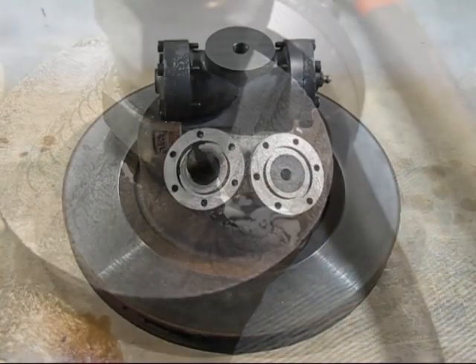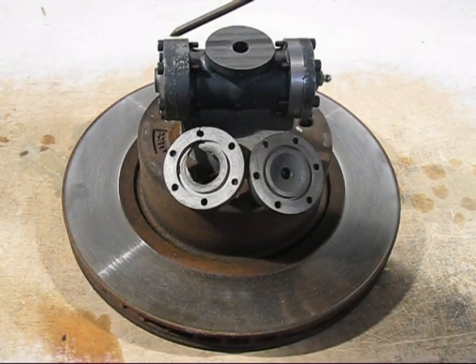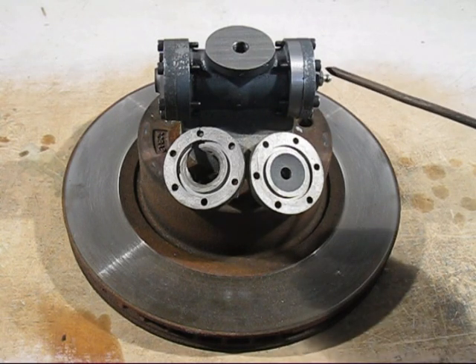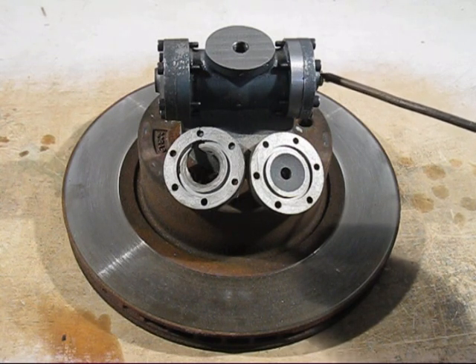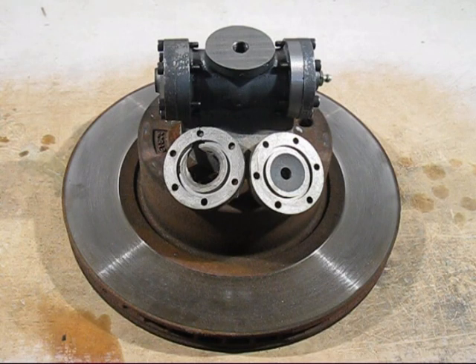So here we are after the pressure test — it worked extremely well. I was pleased. What I was aiming for was to see if these two covers would break like that one there, and they never did. But when you've got really high pressure, I found out one thing very quickly: if it will leak, it will leak. It first started leaking where the grease nipple screws into the cover, then I re-tightened that and that stopped the leak. Then it started leaking around the thread just there — I was just at the hardest pressure I could get with the grease pump and it wouldn't go much further, so I stopped. It worked really well, but at high pressure you will run into problems, and if you want to seal up the leaks you can go a bit further.